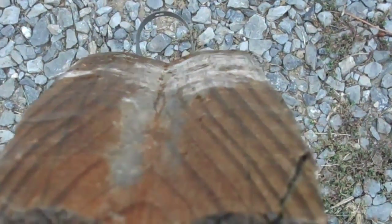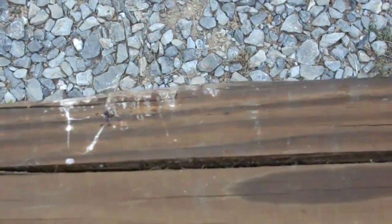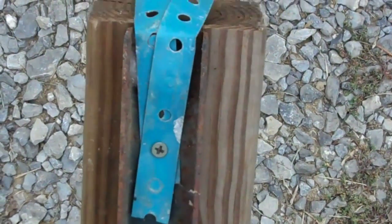After I laid out that arc, I took a circular saw, set the depth a little bit, ran it down the center, and that gave me a depth cut. Then I hacked around with my little hatchet and got a little groove where the pipe would sit in, where it wouldn't slip around on me. And then it started to split too, so on this end, to hold the pipe, I just took a pipe strap, brought it around because it's going to have pressure pulling on it, and bent it around the curve there so it would take the brunt of the pressure and just screw into the block. High tech, man. High tech.